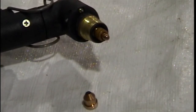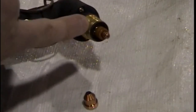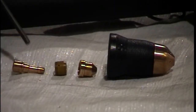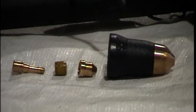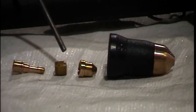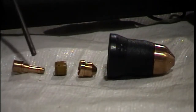The next piece will be the swirl ring on the electrode. Make sure you don't discard the swirl ring by accident. Remove the electrode and the swirl ring from the electrode. Once you have your torch head disassembled, you will see your electrode, swirl ring, nozzle, and your nozzle holder. The nozzle and the electrode will be your most commonly replaced items — they will expire the fastest. The swirl ring may be stuck around your electrode, so be careful not to discard it with the old electrode.